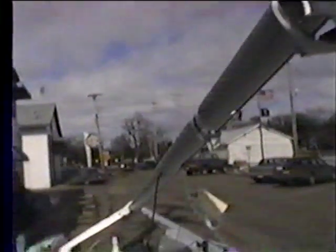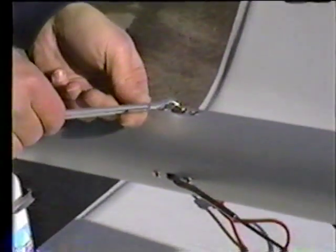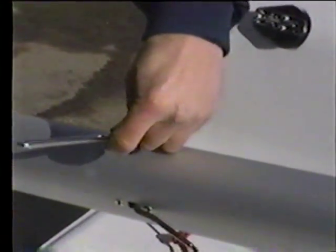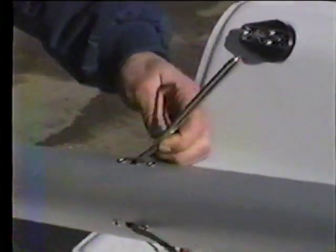The Johnson 18 does not have a jib halyard. At the very top of the mast, all there's going to be is a small hole, very much like what we use to put your side stays and lower side stays on. There's a T-ball fitting — you'll probably find it in the spinnaker bag or attached already to the top of your jib, but we're going to show you the pieces individually. It fits in place — it's just a small toggle, what we call the jib toggle. It fits in very simply: turn it to the side, stick it in, and then pull it down. There's also a small black fitting which will lock that in place.